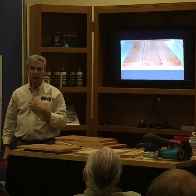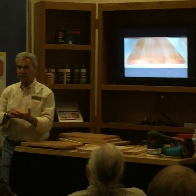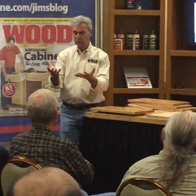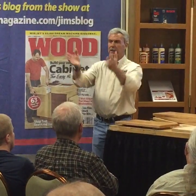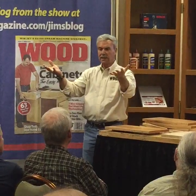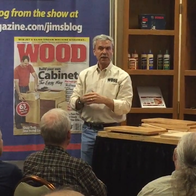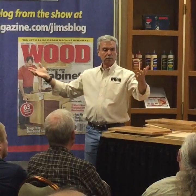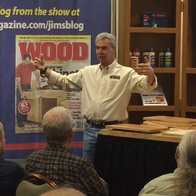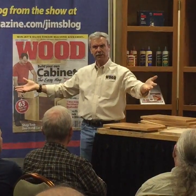When I was much younger, and probably when you were too, they taught everybody at that time that you had to alternate every other grain. That was the idea. The reason was, if the middle board wanted to cup up, that if you put a board whose grain ran opposite directions on either side of it, somehow it would keep that middle board from doing something stupid. And even if it worked, what did the outside boards register to? Because ultimately it's over. You have to have outside boards, so why didn't they do something dumb?